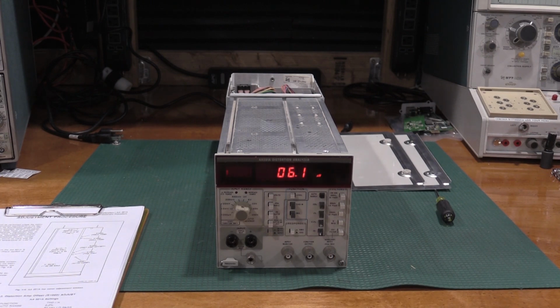And just to give an example of how important warm-up is, the 7110 actually has a counter when you turn it on. It logs an event in its event log that says its warm-up has finished. So the calibrators have been on as long as the 7110's been on, because they need an hour and a half or better to warm up. Everything else in the lab needs about 30 minutes, so it's been on for a little while.